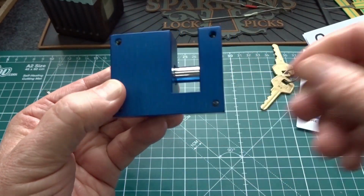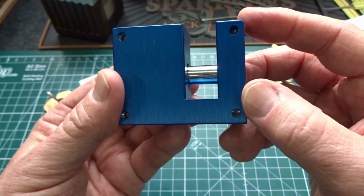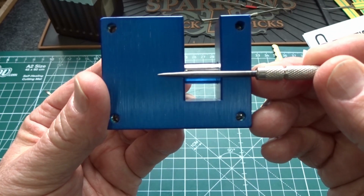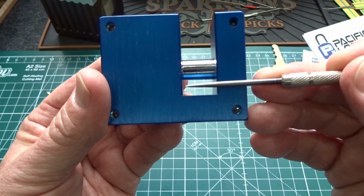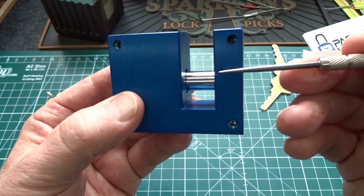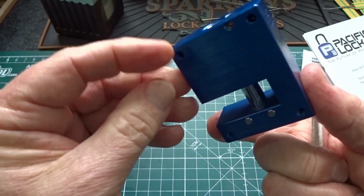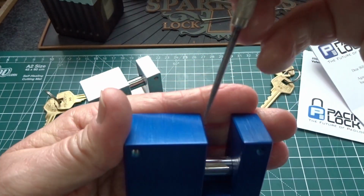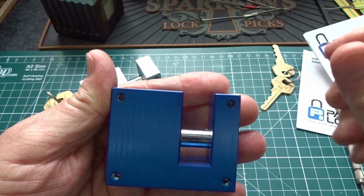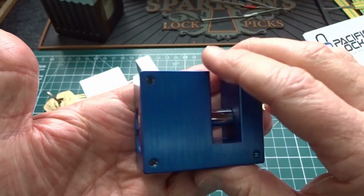What differences are there? I'll put the link of the original review of the V1 down in the description if you want to take a look. But one of the things we talked about was moving this shackle. When the shackle was down this low, this gap is really small, so it really constrained you in terms of how large of a hasp will fit inside of there. Also, if you wanted to use this to lock up chains, like if this was fastened to a door through these screws, going through the top, there's no links that are long and thin enough to be able to get down to that shackle and be able to be locked up. So if you were to move that up, it would be a much more flexible lock, and you'd be able to use chains on it.